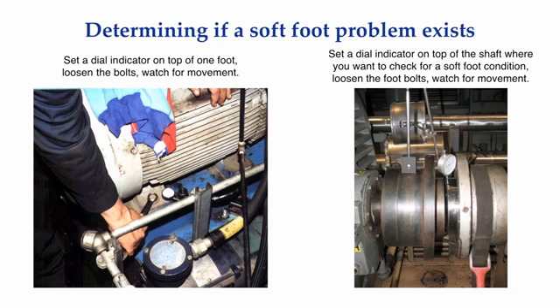If you are going to observe what happens at the feet, the ideal way is to get four dial indicators and four magnetic bases and set them up at each of the four corner bolts. Set a magnetic base on the base plate, set the tip of the dial indicator on top of that foot, and plunge the stem of the indicator in a little bit. This doesn't count if the indicator is not touching the foot. Then loosen one bolt at a time and observe what happens to the dial indicator. When you loosened the bolt with the wrench, did the bolt feel like it was already loose? If the foot lifted up — which is usually what happens — and you see more than four mils of movement, stop. You have a soft foot condition.